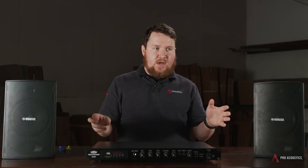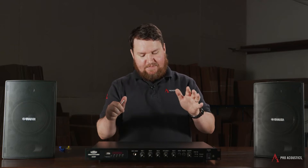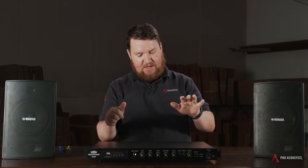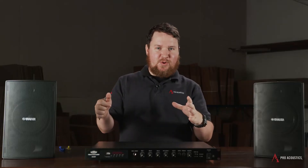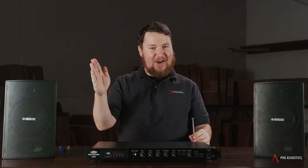So what 70-volt taps should you use? Typically we want to tap speakers at basically the highest available tap setting for the application. In cases like restaurants and things like that, we normally don't need 200-watt speakers. So if you've got a speaker that has a 200-watt tap, you probably don't need it quite to that level — that's not the desired tap setting.